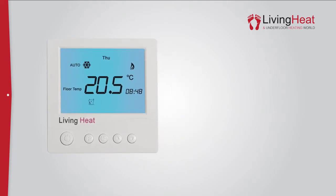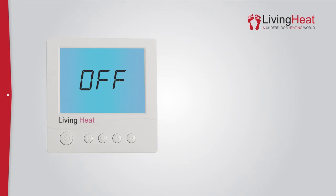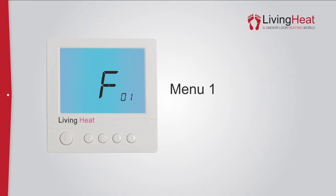If the thermostat is currently showing the home screen, click the power button once and the thermostat will turn off and the off screen will show. Once the thermostat is in the off position, push and hold the P button for 3 seconds. Do not click the P button, as this will not access the settings. You need to hold down the P button for 3 seconds to access the menu settings. Menu 1 should now be showing.